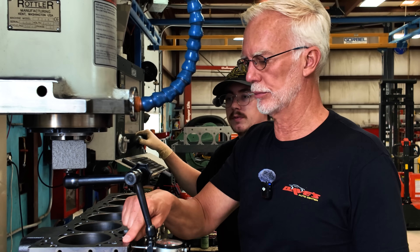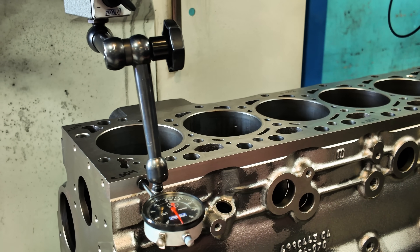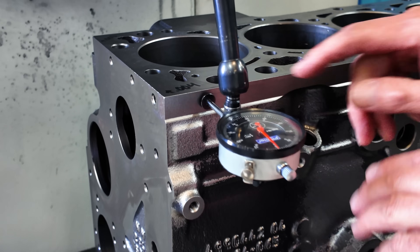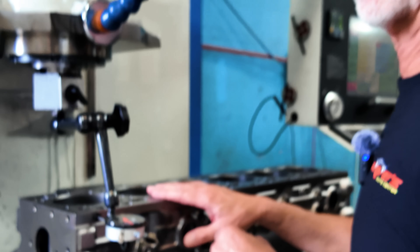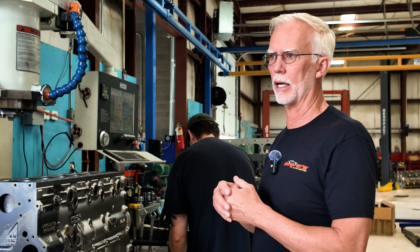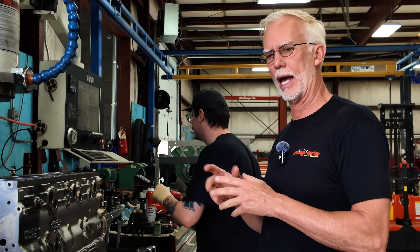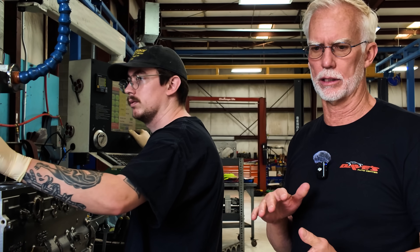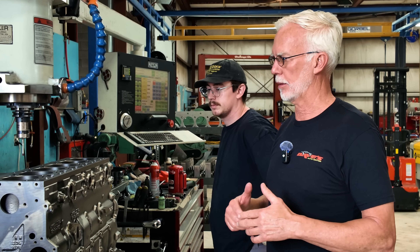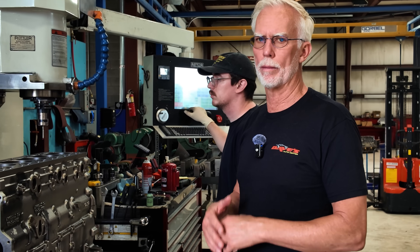He's probed the top of it and marked the distance. It looks like it's mainly low right here — somewhat flat and then it kind of just falls off. He knows that to clean this up it's 4 thou here, and then we'll check the surface because we want the proper surface finish. He's going to take about 6 thou off the deck of that block — that's not so much that we've got to buy domed pistons or anything like that; we'll still be good on our compression. If we were going to do more than that, or if the head had been done or the block had been done again, we could use a thicker head gasket to get the compression ratio correct. As a custom engine builder, it's up to us to follow all those things to build the perfect motor — not just something that's been machined, whipped together, and the things aren't right.